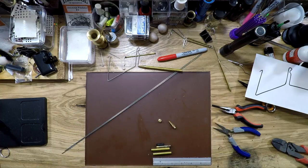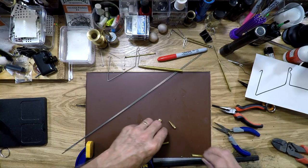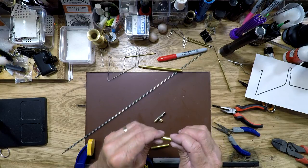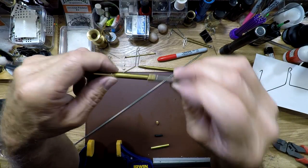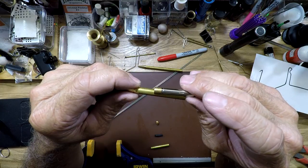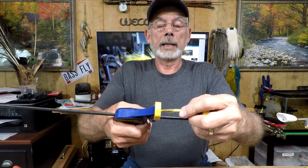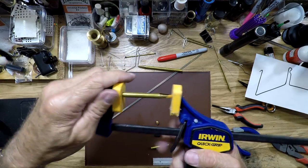I didn't go over all the tools — I've also got an Irwin quick grip, and that's used to press the pin parts together. Don't put the mechanism on first — you want to put the tip on first because it's got a positive stop, it'll only go in so far. If you put the mechanism on first, when you press the tip in it'll push everything in even further. So put the tip on first — just take your Irwin grip and close it together, and that gap will close up right there. Done.